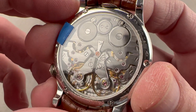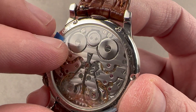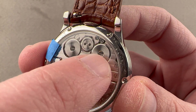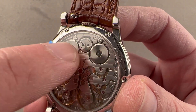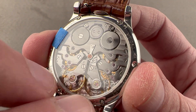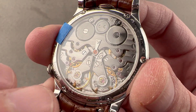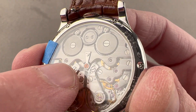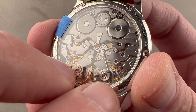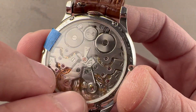The movement here is different than the ones that came after. In mid-2004, this design was converted over to rose gold, but the architecture changed too. Look at one of the newer watches and you'll find that you see the barrel arbor centers, but you don't actually see the ratchet wheels. This bridge architecture that gives you the clicks and the ratchet wheels is considered to be more aesthetically pleasing. We have two balances, both free-sprung, both beating at 21,600 vibrations per hour, both adjusted in six positions. And then there's a little rack and pinion at the center — you can see the gold pinion and a black-polished rack — used to very precisely adjust the distance between the two balances to encourage coupling via resonance.